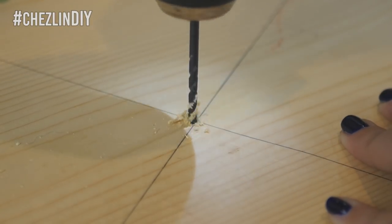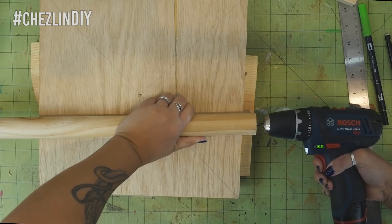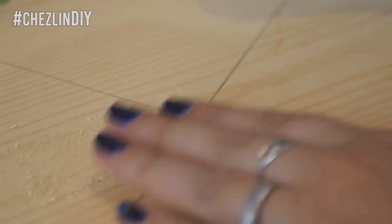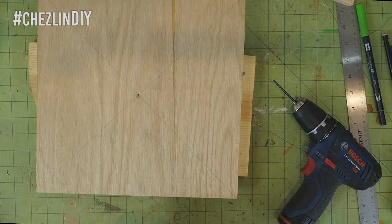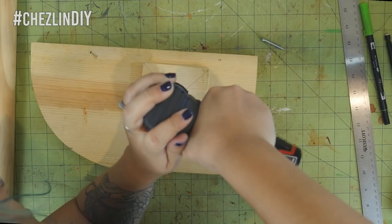On the base piece, drill a pilot hole. Make sure to use a piece of scrap wood underneath so that you don't mess up your table. Then carefully drill each end of the dowel, trying to keep it as straight as possible. Switch to your countersink bit and press it into the pilot hole of the base piece — this makes a little indentation where the screw head will sit. The side you're drilling the countersink into will be the bottom. Then with a bit that's bigger than the screw head, drill into the smaller piece of wood about halfway through.